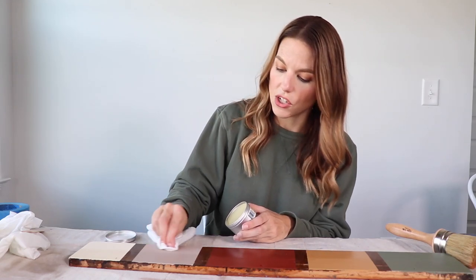Big Mama's Butta is not as protective as Best Dang Wax, but it will cure faster — this cures in seven days, so that's the fastest curing product they have. The hemp oil is 21 days, and pretty much all the top coats I would wait 30 days for them to be cured. Dry time is different than cure time. Dry time is when the top coat is dry to the touch and you can recoat it or move it around very gently. Cure time is when it gets down to its hardest state — completely solid and protective. At that point you can use some mild soaps or cleaners on it and be a little more aggressive with it. I'm also going to apply some of this Big Mama's Butta in Flannel with a lint-free cloth if you don't feel like using a brush.